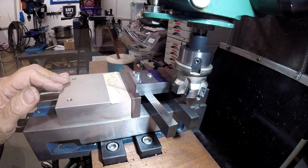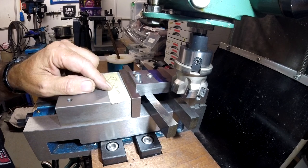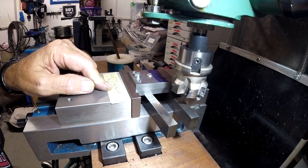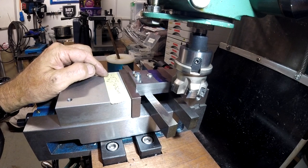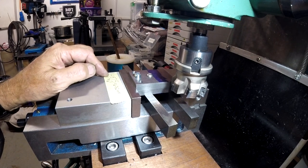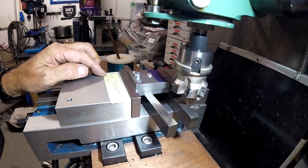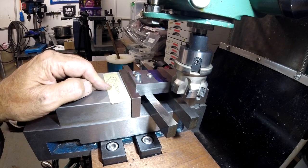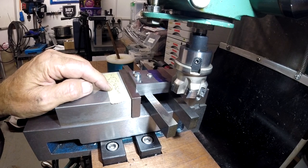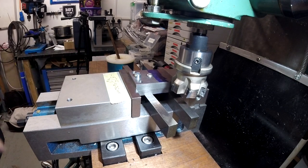and I'm going to paste that on there. I've actually changed my mind. I'm not going to do it imperial, I'm going to do it metric. It's probably easier on that DRO scale, because if I go to imperial, it's point nought nought nought nought nought, up to 5 noughts. This way, it's smaller increments, only 3 decimal places, 4.762. That'll do me. I'll double check that though.